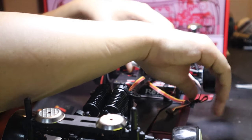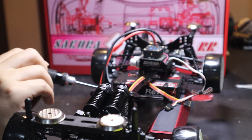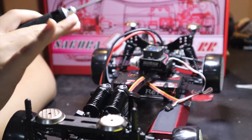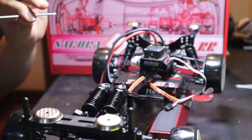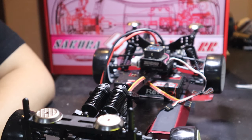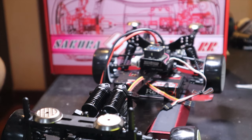For electronic parts, we will be mounting the ESC right here. For the gyro — it's already here and I will review the gyro tomorrow, as well as the remote the customer bought. It's a budget remote as well. The receiver will be going all the way down the deck, and the gyro will be down here too. The book puts it on top, but the reason I don't put it on top is because the gyro's sensitivity is not as accurate up there. When you're drifting the lower deck is actually moving, so the upper deck gives you stiffness and flex. I do recommend — if you get this budget kit and don't have much budget — put your gyro at the bottom where the receiver is next to it.